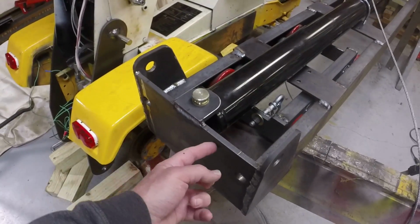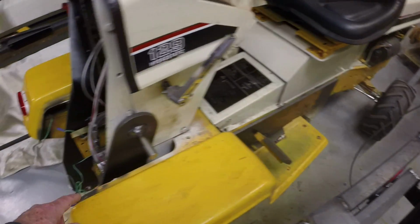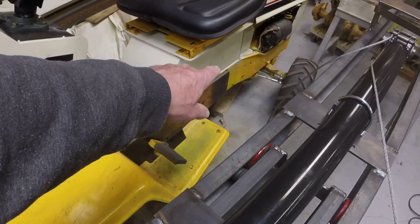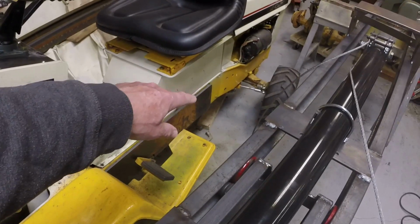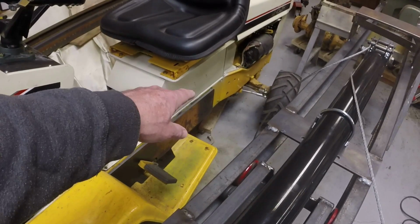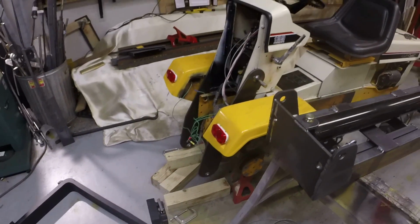So we'll drill 2 holes here, and then we'll move over to the tractor, and in this subframe that we've built, I'm going to drill a couple holes on the forward end, put a couple bolts into the frame to hold that end of this 3/8 inch plate steel frame reinforcement, or call it the mast subframe, and bolt that to the tractor frame. So got a couple things to do here this morning. We'll see how much we can get done.